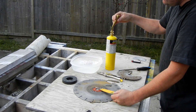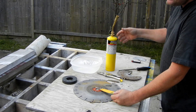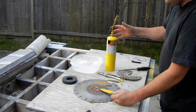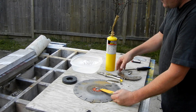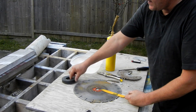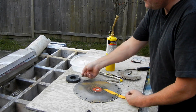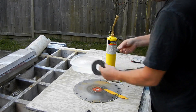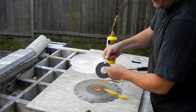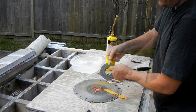To do it, I've got some MAP gas. MAP gas is quite a bit hotter than propane — you can still do it with propane, it'll just take a little bit longer. I'm going to quench it in water, just ordinary water. I've got a magnet here to test: once it gets up to temperature, it shouldn't stick to the magnet anymore. That'll tell you if it's at the stage where it's ready for hardening.